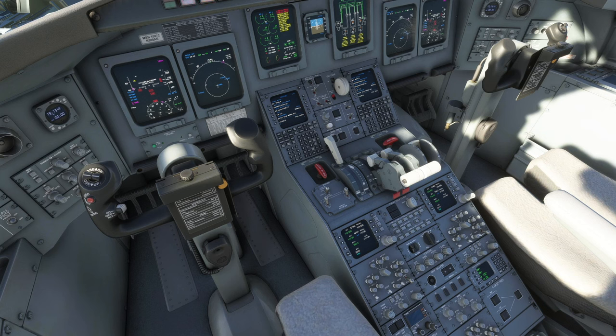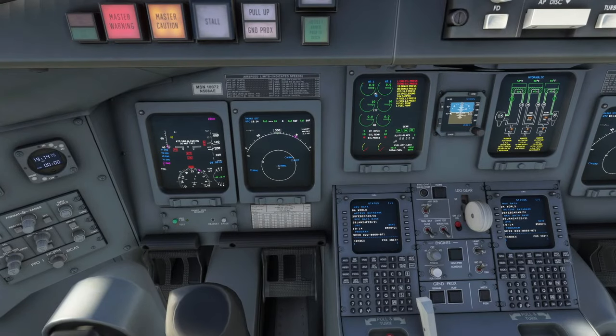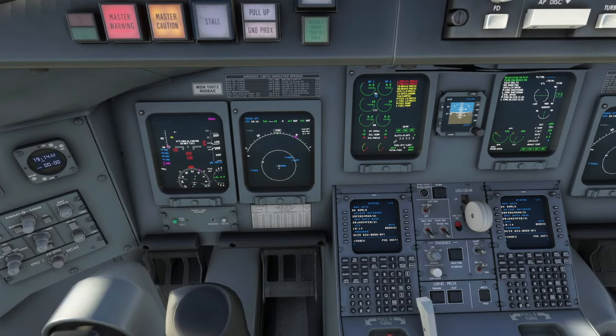Next is our TCAS test. So on the RTU, which is the radio display, to the left of the throttle quadrant, select TCAS test. And we can see the indicators on the PFD as well as the audio warning. So that's working. Now down to the lower pedestal. We'll turn on the stabilizer trim left and right and the Mach trim. And then we'll turn on yaw damper 1 and 2. Go to the status page and verify that all those are cleared from the status.